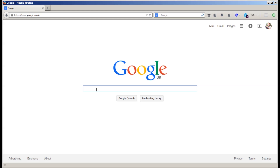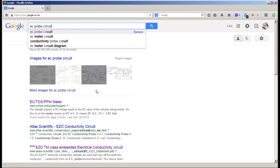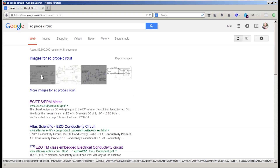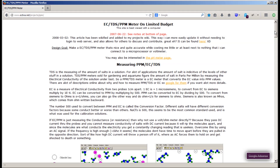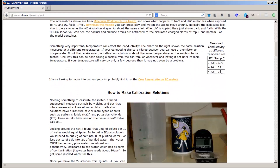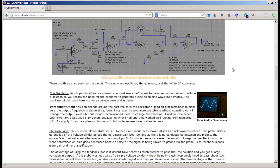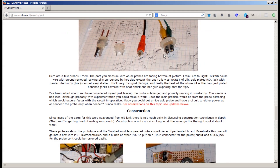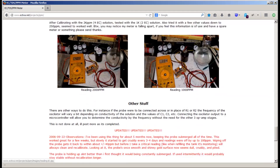Being a curious kind of guy, I did the obvious thing and Googled for 'EC probe circuit' to see what I'd get. There seemed to be a circuit diagram as the very first link. It turned out to be a page by a lady called Isabella, who has built her own EC meter and made her own salt calibration solutions — half a litre of water plus one gram of salt gives you a 2000 PPM solution. She put together her own EC probe using gold phono terminals, sealed up so only a small part is exposed, and built a circuit to drive the EC probes and measure EC and pH.